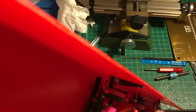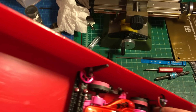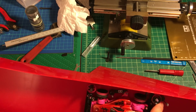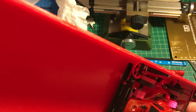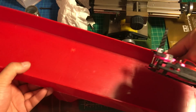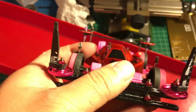Okay, if this one is attached to the wall right here, you have to use sandpaper to make it a bit thinner. Okay, so again, the best distance is 1.5 to 2 millimeter. Okay, so like this. So this one is fine. So it's gonna look like this. So make sure the lock is a little bit tight, so this one will move, like this one right here. This one has to move because you have to lock the lock nut really tight.